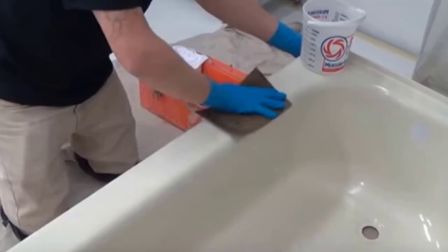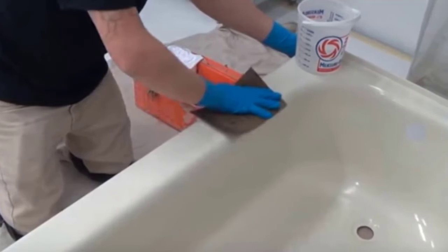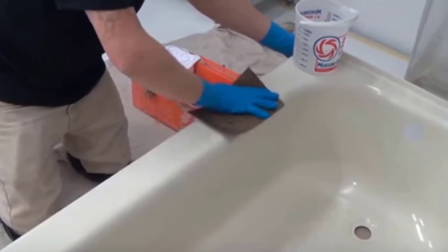Sandpaper. A lightweight sandpaper or cleaning screen can be picked up in just about any hardware store in existence. Dampen your sandpaper or cleaning screen and let it sit for a minute before you start gently rubbing the rust away. Scrubbing too hard can result in permanent scratches in your tub, so do be gentle.